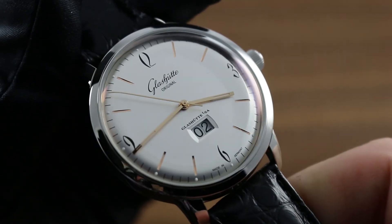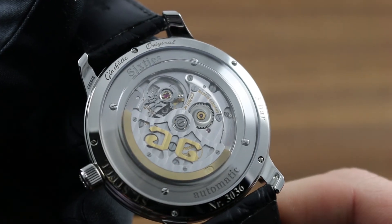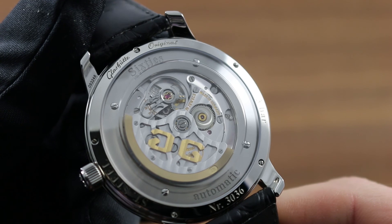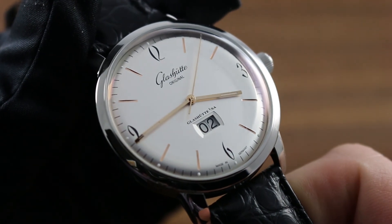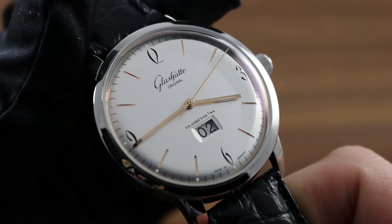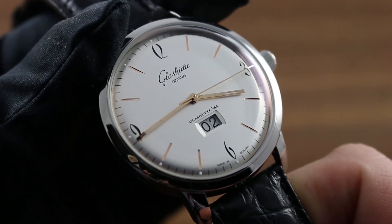Water infiltration invariably becomes a greenhouse for catastrophic mechanical and cosmetic consequences. Furthermore, unlike mechanical specifications, water resistance of a watch is never a static feature — over time, as seals age and lubricants degrade, your watch will be relatively less water-resistant. Therefore, Glashütte Original recommends taking your watch to an authorized service center at least every 12 months for a dry static water test to confirm original factory hermeticity is still intact.